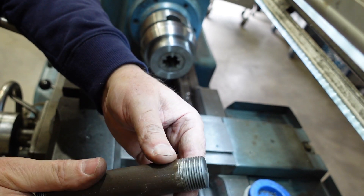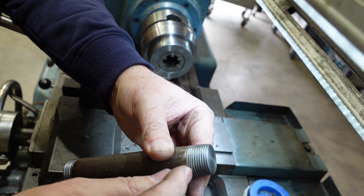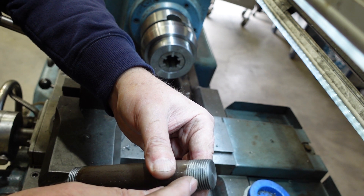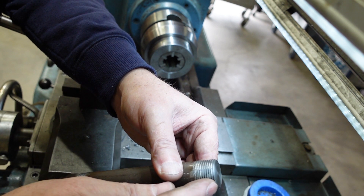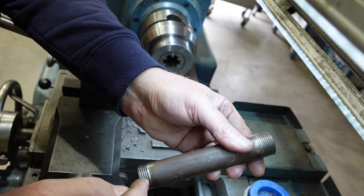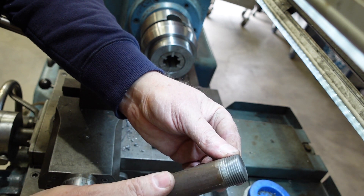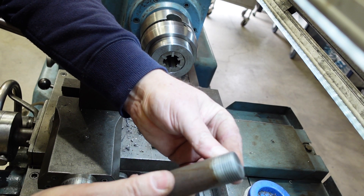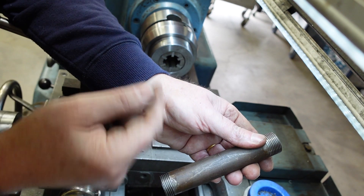This is my resultant thread - it's full depth, which is what I need, about 10 millimetres or so. Because I'm doing this without a groove, I need to set the lathe going and then bring the tool in to depth. The first few passes it's just a matter of winding the tool in, but towards the end you have to wind down to a specific depth - in this case the same as the other end, 92 thou. Now I've got a left-hand thread. Now I need to hex up some round stock to make some nuts.